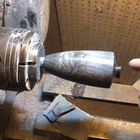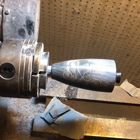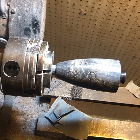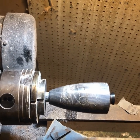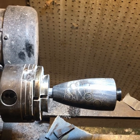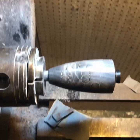What I did on the inside of the vase was I used a two-part epoxy that's made by a company called The Rot Doctor. And it's a penetrating epoxy. The issue with that is it does yellow, but on the inside of the vase, you're never going to see it. So I poured it in there, I sloshed it around, I did like two coats, and then I let it set up. Then I kind of cleaned up the outside, and now I'm going to do the CA finish.